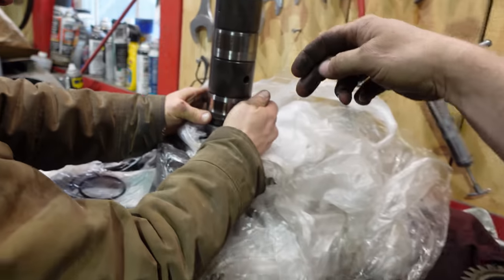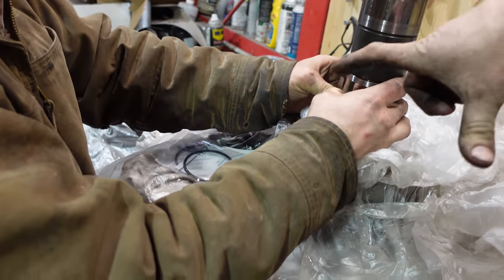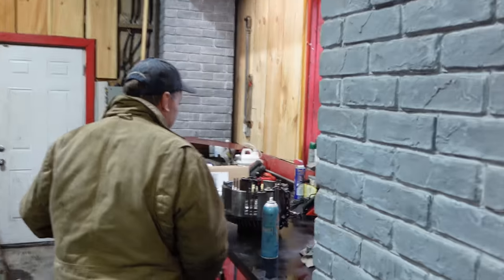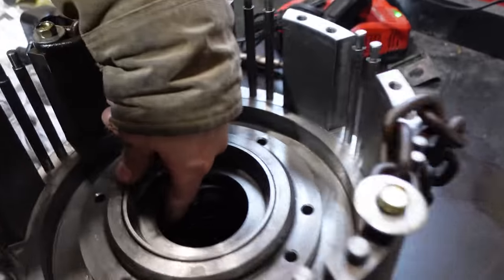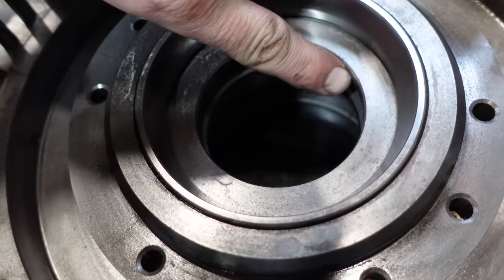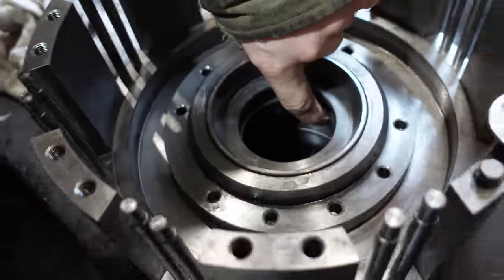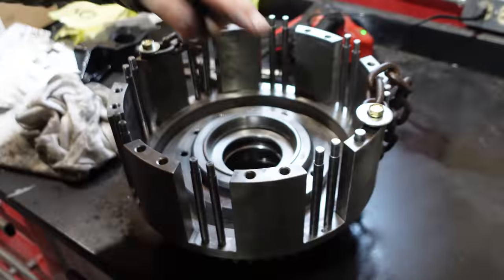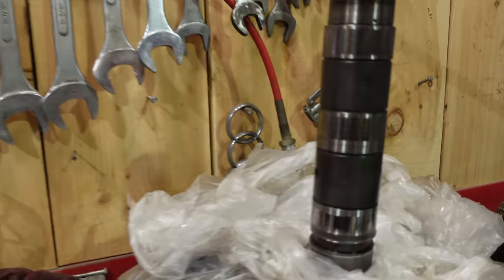Keep in mind that whatever shaft you're putting this on generally has a tapered slide. Squeeze it together here so it's got to go on. So it is tapered. You've got to make sure there are no grooves in here, where the seals run. Sometimes they'll wear a groove and that's bad. Then you get to buy one of these, or get Vince to weld it up.